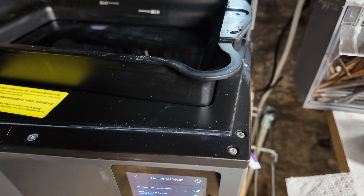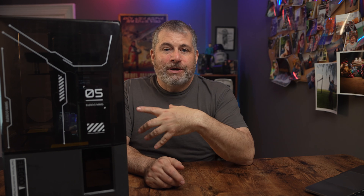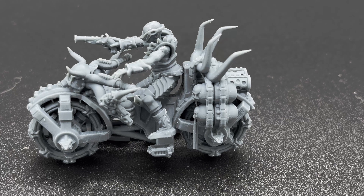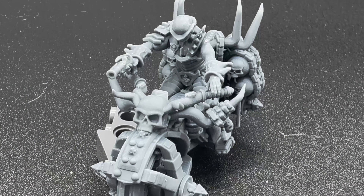The next innovation is really pretty awesome. The printer uses a tilt release technology — it tilts the resin tank during printing, which helps reduce suction and increases print speed. This printer can reach up to 150 millimeters per hour, which is impressively fast for a resin printer. A plate of miniatures took just two hours to print.